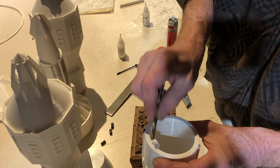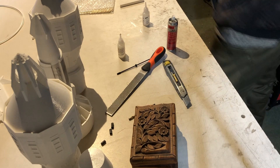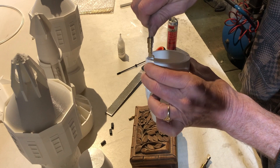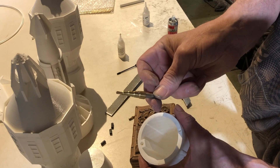It's better to cut holes into 3D printed stuff not with a fluted drill. I find a little stepper drill much nicer to work with on this material. I can take that into the next size and it'll give me a little bit of room, but what it's not going to do is pull down into the material. Once I've got that going, it's going to cut horizontally - my pressure will take it down, not the drive of the screw thread. So use one of these if you're drilling into this.